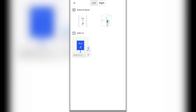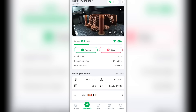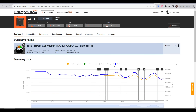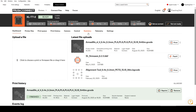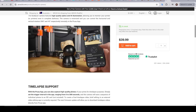The next area I'd like to compare is remote control and monitoring. I know not everyone likes the cloud, but Bambu Lab does do this well, with a webcam built right into the printer by default. Creality again copied this functionality. Previously, Prusa's equivalent — Prusa Connect, which works over the cloud — was quite lackluster, with missing information and no way to have a real-time camera feed. Consequently I ran Octoprint. But this time I was keen to give Prusa Connect another go: it's had development and features added, running nicely out of the web browser as well as being embedded straight into PrusaSlicer. And mainly, the Buddy 3D camera has been released, which gives a real-time feed with a motorized head so you can monitor multiple 3D printers.